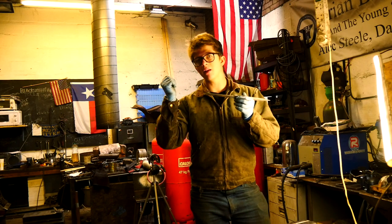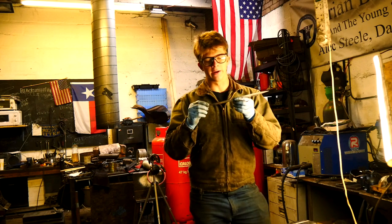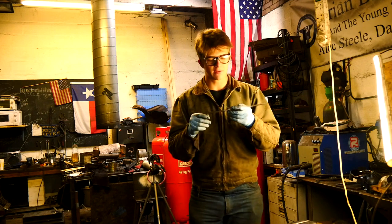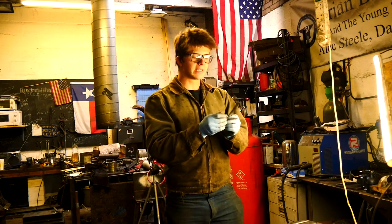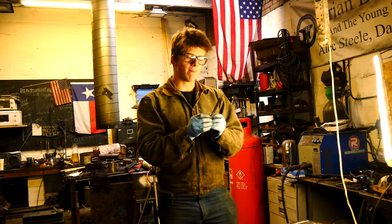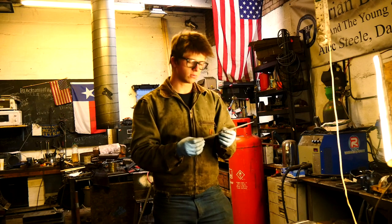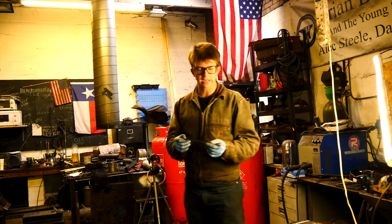So I have a four millimetre hole that's threaded on that thing that goes on the end. What I'm definitely going to need is to grind this down, round it off, and then thread the very end. I'm also thinking it'll help a lot if after the guard, I severely reduce the cross section of this handle so I can put it almost straight into a hole. We'll see if that makes any sense — I'm going to try it though.